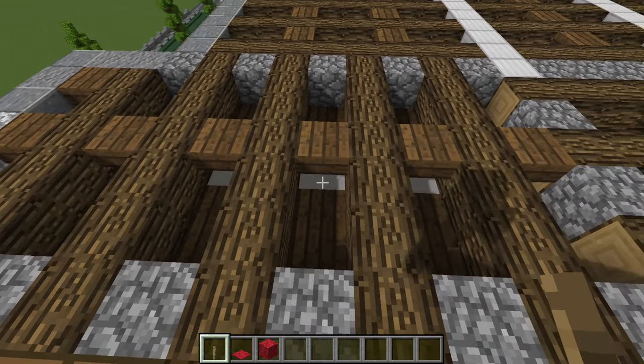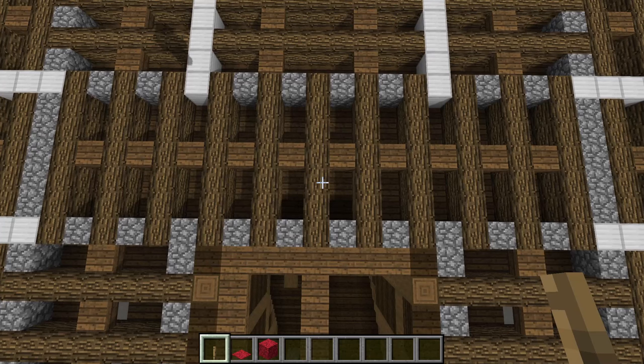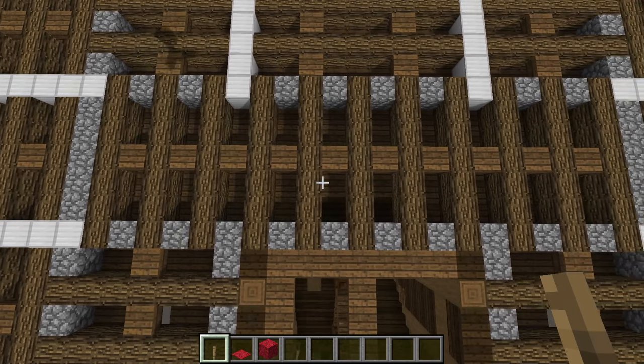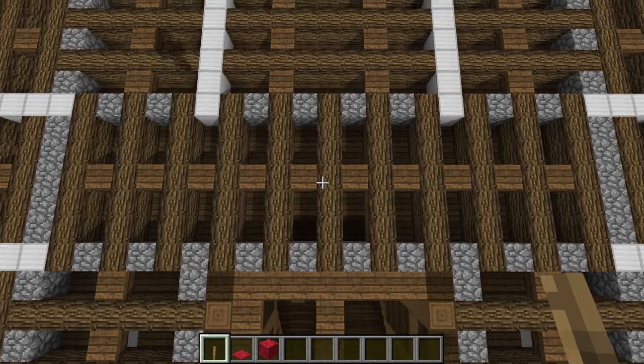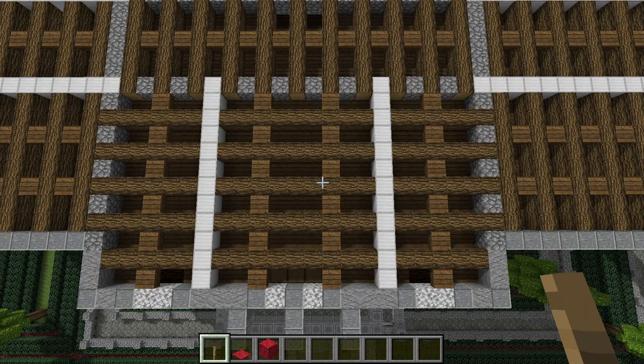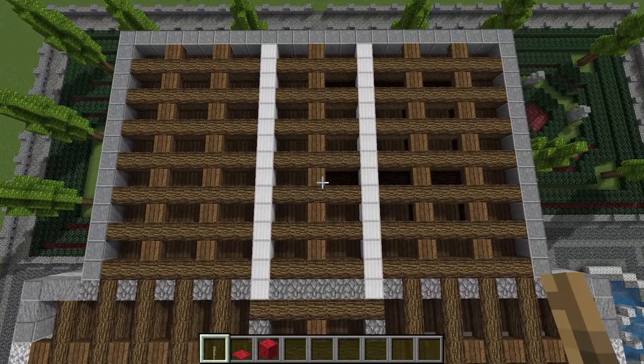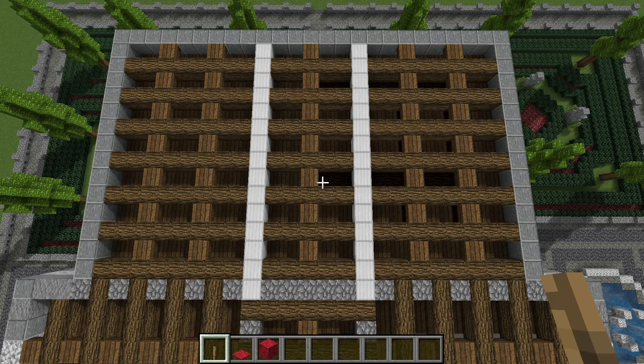One bathroom is pretty much like the next. Then behind that we have the hallway — wood beams every other block and noggin spacers every other block, right down the middle. Behind that we have the iron beams for the next floor, with wooden beams tying into those and tying into the pockets along the wall. Then all the noggin spacers — four rows of those. Over to the left, the rooms over the library and the guest bedroom: we have two more iron beams, a lot of wooden beams, and five rows of noggin half slab spacers.